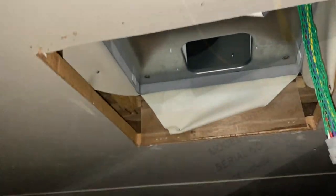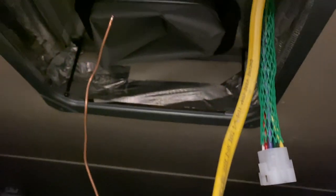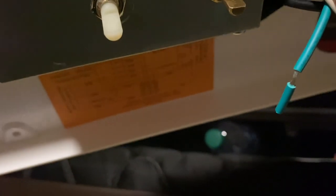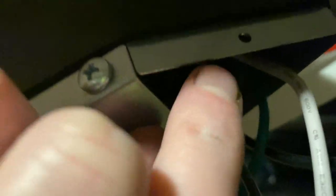Just ran the wire into this assembly. Had to take it back out and straighten the wire to end up with enough slack — you need quite a bit. Some of that you can push back in and re-tape, but you need to be able to reach out to the center. The boot is kind of folded up there but this is basically ready to get wired up — pretty simple. There's a little triangle piece that goes over with some screws. Be careful — the screws are sharp sheet metal screws and they stick out the back side, so make sure no wires are near where the sheet metal screws go.